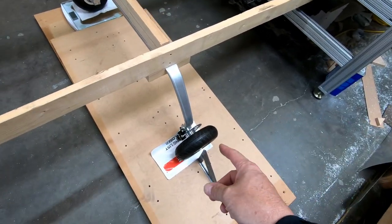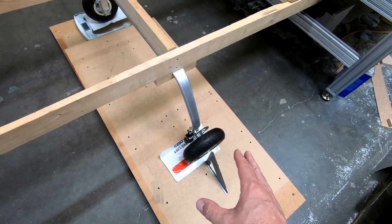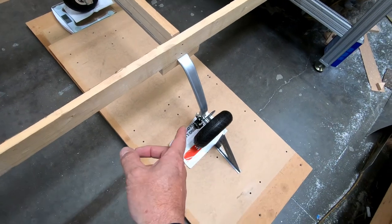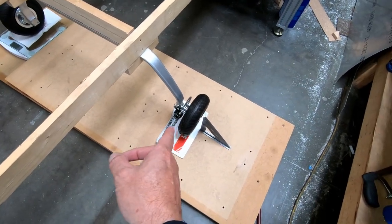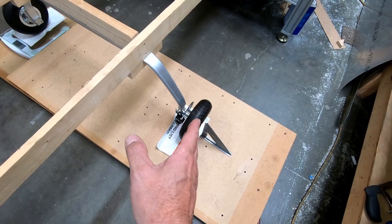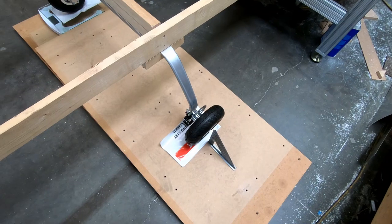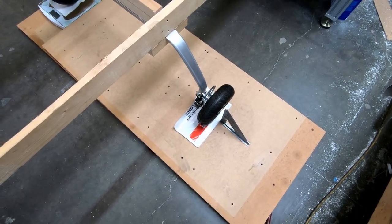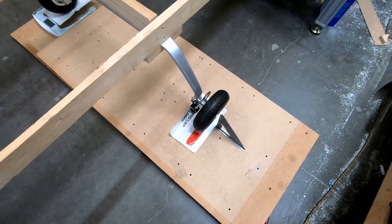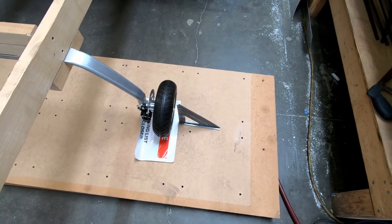And what I want is to check and see how much my axles are bending, if at all. They shouldn't be. And I'm going to check that by checking that brake clearance just to see if that axle is flexing at all. That brake disc is going to go over and rest on the inside pad. But I'm hoping that I'll just see exactly the same gap, which means the axle is not flexing at all. But the other thing I said, I do want to check if the tires are vertical.